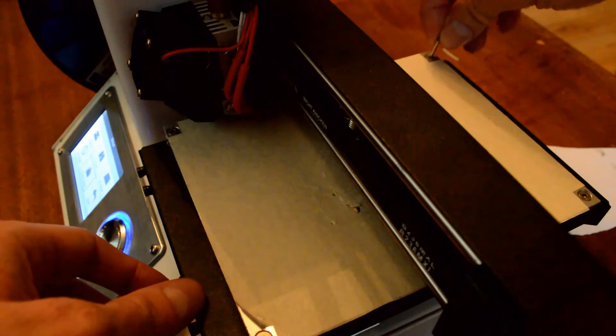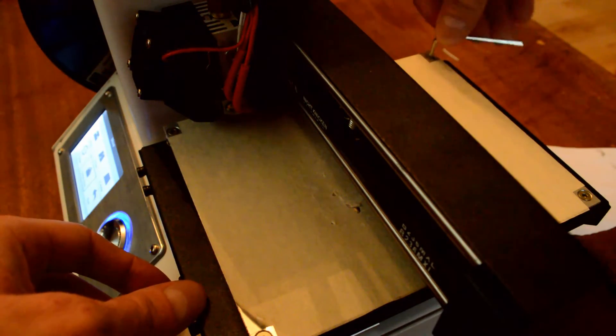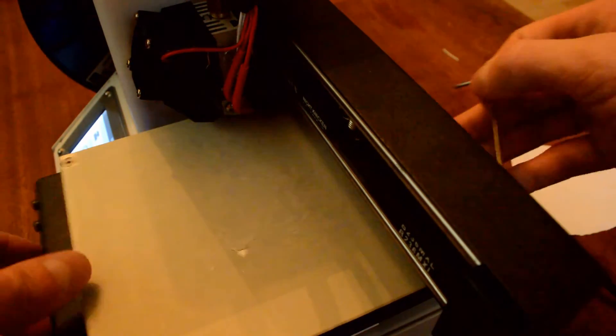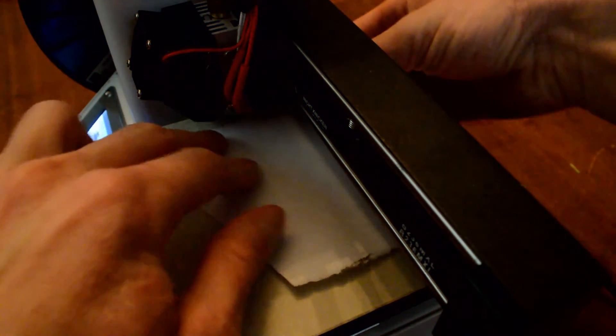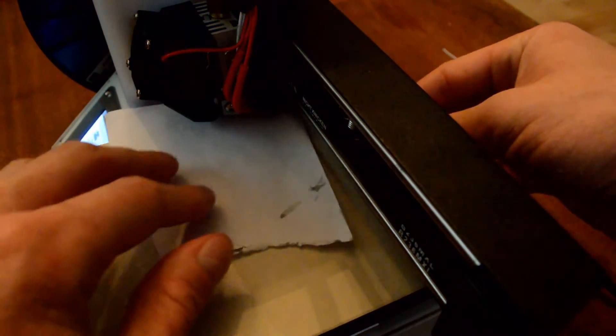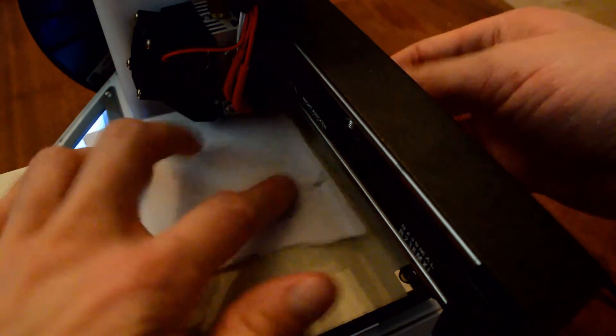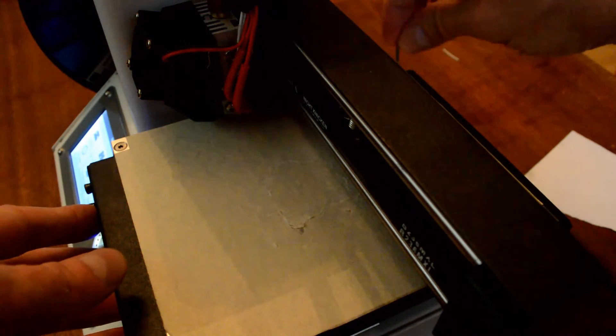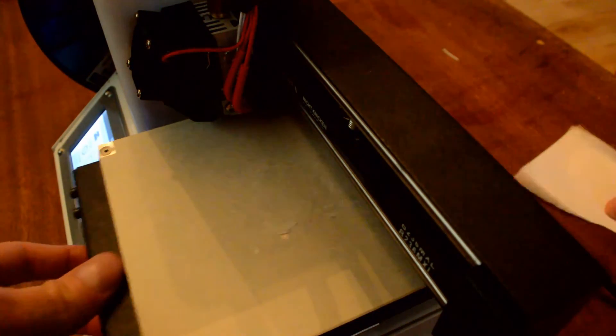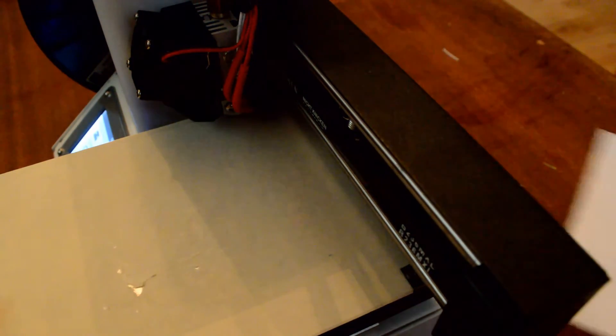To fix that, I'll tighten this corner down about a quarter turn. Put the paper underneath and move it over — you can see the paper gets dragged with it, it's still a little too tight. I'll do another quarter turn. Recall I did a half turn on the other side. Now I like the way that feels over here.